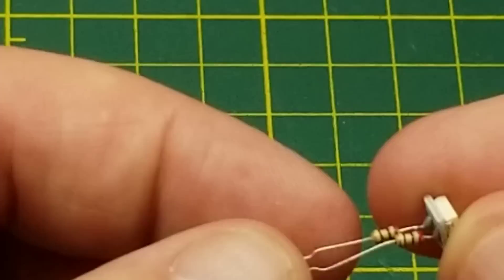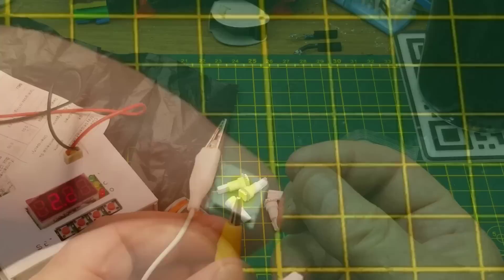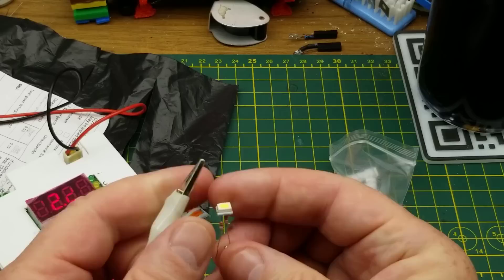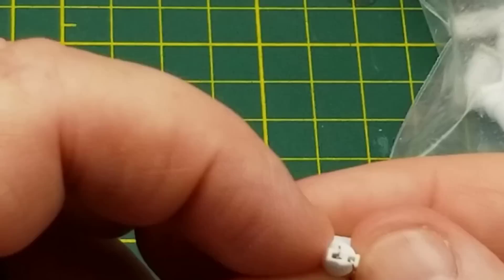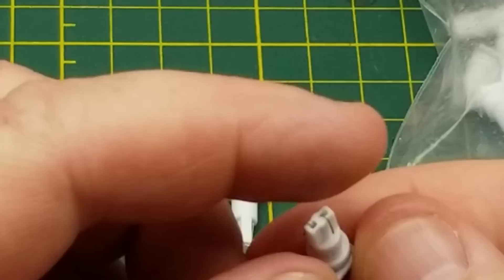I'm still claiming that it's a 12-volt device. So with approximately 12 volts on the power supply, let's see what happens. Nope, doesn't light up that direction, so it is polarized as I suspected. There we go. I would call that a cool white, maybe a bright white — definitely not warm white. Looking at the base, it doesn't look like it's got anything to key it polarized, so you'd have to just plug it in and try it in your car.